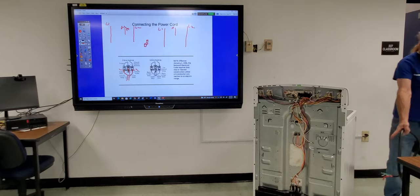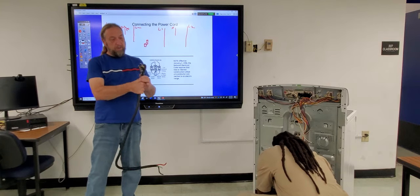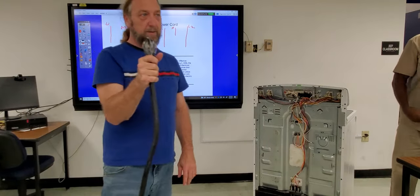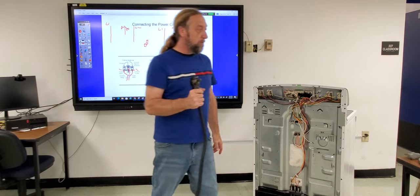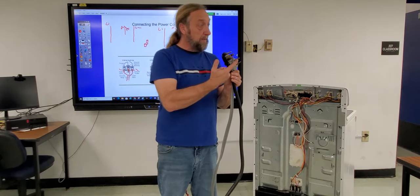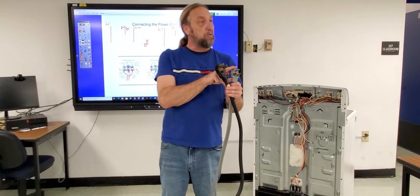Let me show the difference — here's the four-wire cord. Is this a range or a dryer cord? The difference is that the center prong on the dryer cord is L-shaped, while this one has a flat center prong. Both dryers and ranges should now be four-wire by code. A flat center neutral means it's a 50-amp stove cord; ranges are 240V 50-amp, dryers are 240V 30-amp.